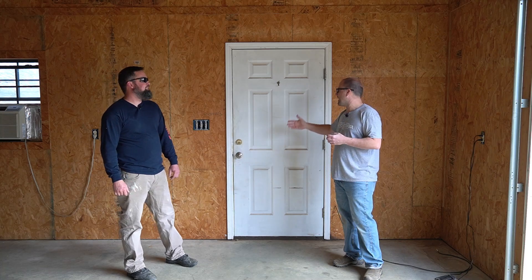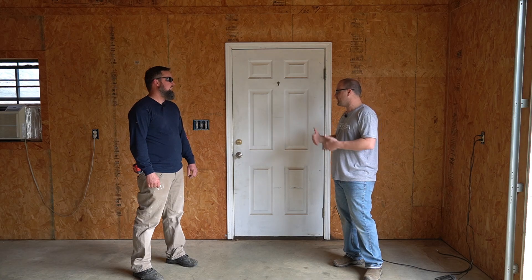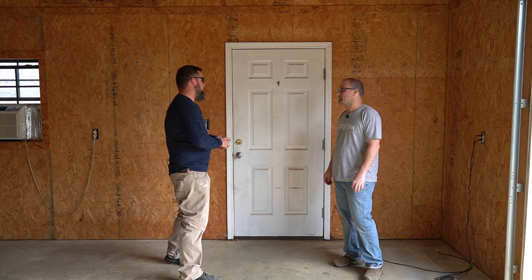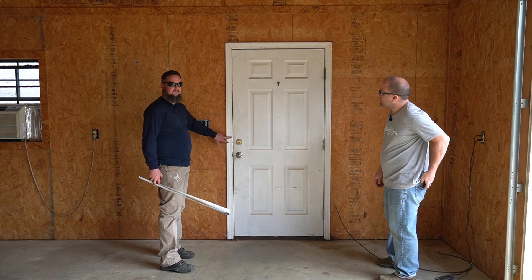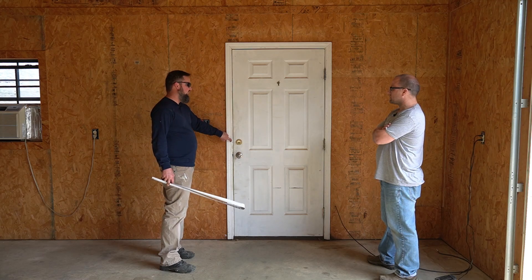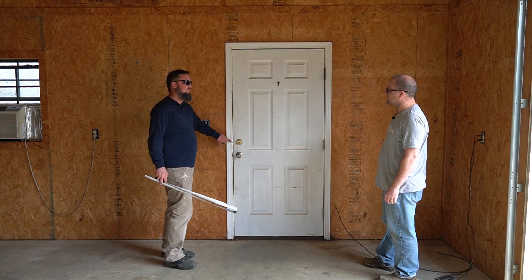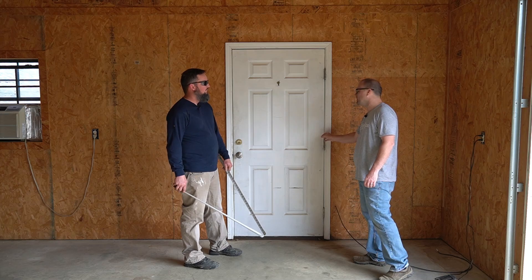So I come to you and say I need a door with blinds inside the window — what's the next step? The first thing I'm going to do is measure your door and make sure what you need is in stock. This is 3356 trim — just colonial casing. I'm generally measuring from the first ridge in the trim, because this is a three-quarter-inch board right here on the jamb. I'm basically making believe I can see through it and measuring from there to the same thing on the other side — the first ridge in that casing.